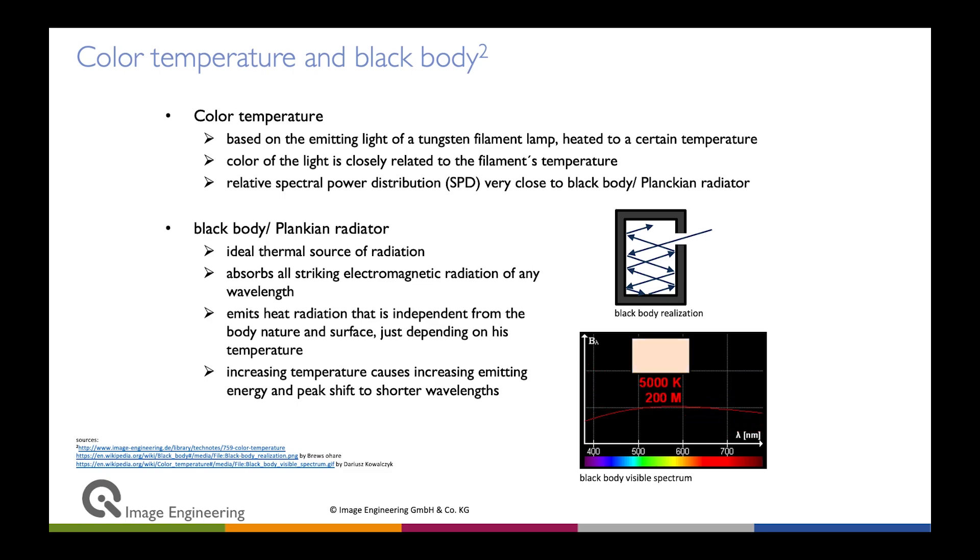You can describe a light spectrum in different ways. What is done very often is with the so-called CCT, the correlated color temperature. Color temperature itself is defined with the so-called black body — if you heat up this black body and give it a certain temperature, it will start to emit a certain spectrum. A black body at 5000 Kelvin, which is extremely hot, will emit pretty much white light. Going up to 7000 or 8000 Kelvin it will get bluish; below that, it's reddish. So if you have the color temperature, you can calculate the spectrum — that's a one-to-one relationship.